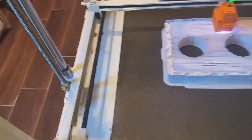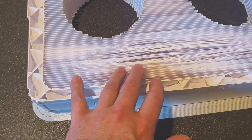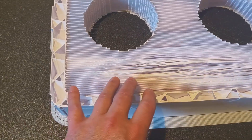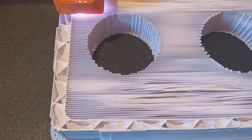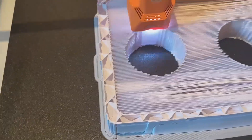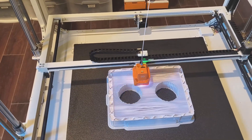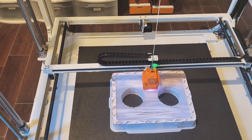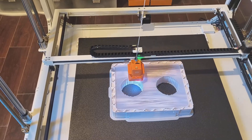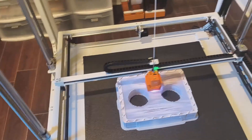Still going, but it's the weirdest looking support. Some of the stuff has like crumbled underneath - I guess it's so thin where it's not putting it down exactly on the previous line, it's folding like paper. The only good news is that all gets covered up in a short space of time, so it shouldn't cause a problem. In future I'll just try tree support - it probably would have used a lot less filament and would have been a lot quicker.